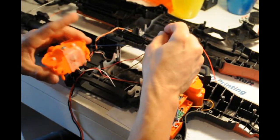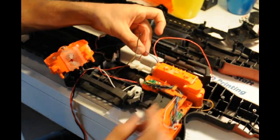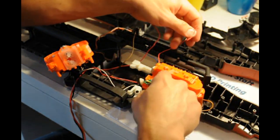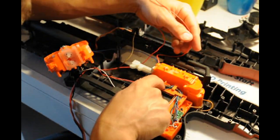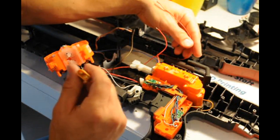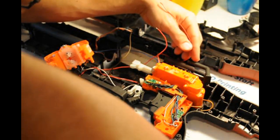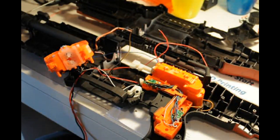And then this positive, I believe either wire is fine. I'm going to connect to this wire here. And then this one, excuse me, I'm going to run in behind here and tack that to this top part. That's the positive pad right there. You can even see, if you look close, and this is stock too, a red wire running on the other side there, tacked into that board. That's the feed to the battery and the motor, everything else. That's the direct battery feed right there for that dart pusher. So I'm going to tack my positive right there.